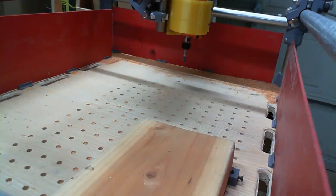Okay, so we want to rotate it to the right. It's 122 by 179. And we're going to do free machining on it. And we're going to rough it with a 1/4-inch ball. We're going to finish it with a 1/4-inch ball. Rough it linear, going with the grain. I'm going to do a 50% step over. And 10% on the finish. I'm going to leave 0.8 for finish.